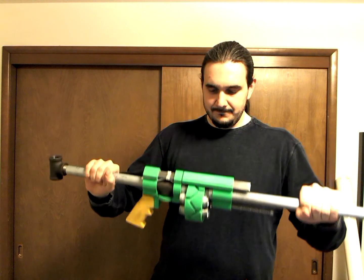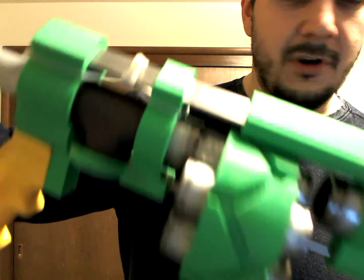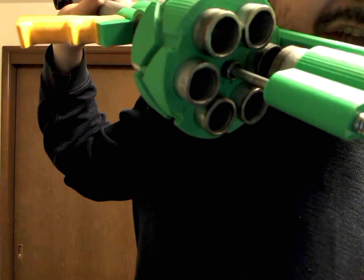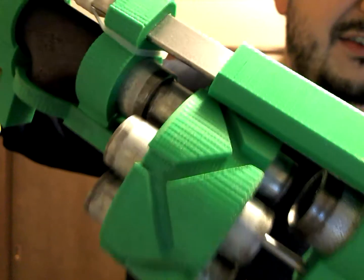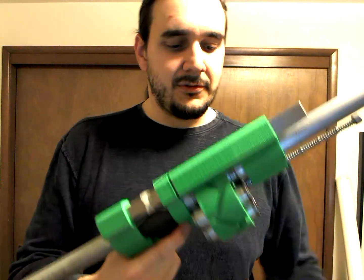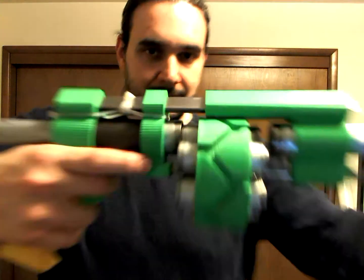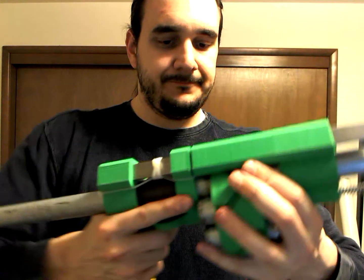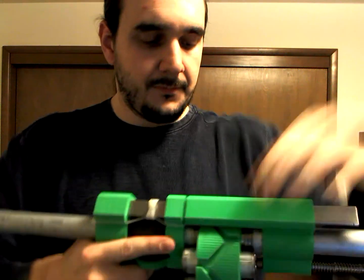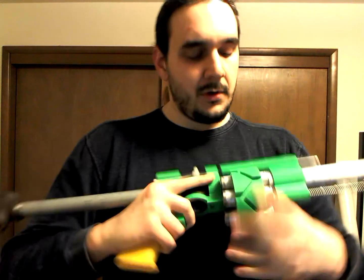See — that's because my chambers aren't glued in there, so they come forward and get stuck. The shaft collar will keep the cylinder from moving forward, but it's not clear of the gas seal. Right now it's a really easy fix — what's happened is the cylinder just slid down, so I just push the printed part back down and now it'll clear. And this is another one hung up on the bottom — just push the cylinder back. Anyway, that's where I'm at right now. Let me know if you have any ideas — like and subscribe, add any comments if you have fixes or ideas for the problems I have.